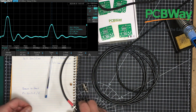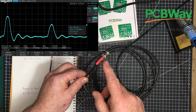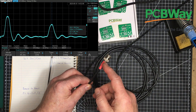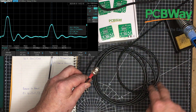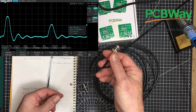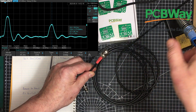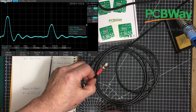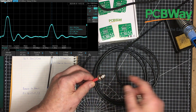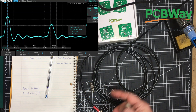And why are we seeing a pulse like that? The pulse is coming all the way down from the reflectometer through the cable and it's hitting this endpoint here. This endpoint is un-terminated — in other words, it's seeing 50 ohms all the way along the thing. It finally gets to here and it sees infinity. So what it does, it reflects off here and then all the way back up again. The reason it's a bit lower — approximately two-thirds the size of the original pulse — is because of losses in the cable. Every cable is going to have some losses in it, and this is not a particularly fantastic cable, so it does have some significant loss within that length.